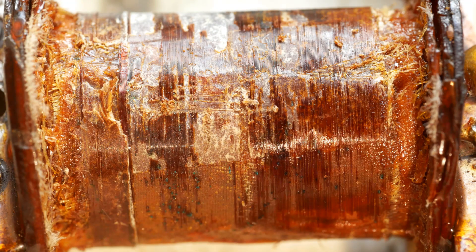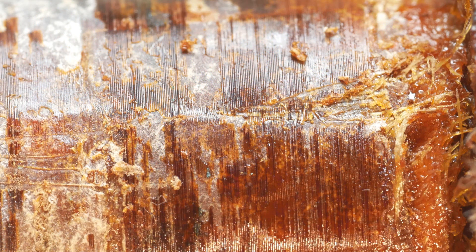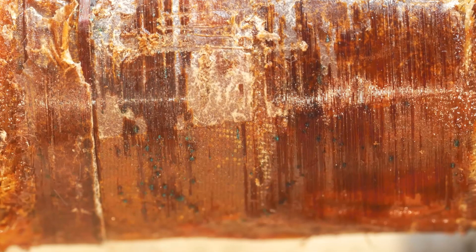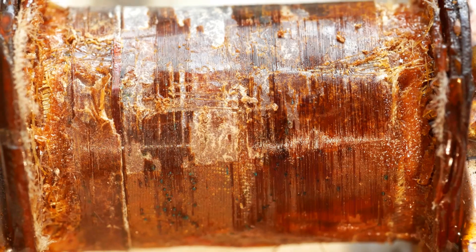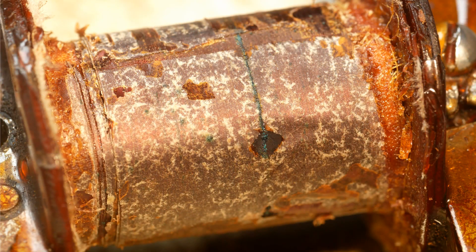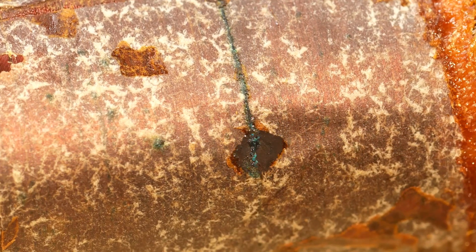When I finally got 24 layers in there was loads of corrosion, and that layer was wound round some thicker cloth rather than the thin paper, so I figured that this was the final layer before I got to the primary coil. You can see the fabric of the cloth over to the right and the impression left in the shellac from where the wire had been. Looking lower and towards the middle you can see loads of points of corrosion in the form of little green blobs. I had to cut the wire off this layer because it was just breaking every few turns when I tried to unwind it. To my surprise, underneath that layer of fabric was more layers of paper and wire. I'm amazed this coil managed to create any sort of spark at all in this state.